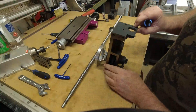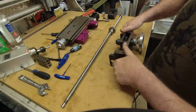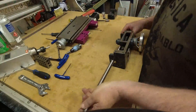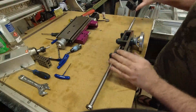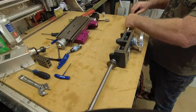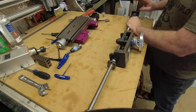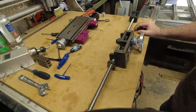We don't tap these holes as yet — we do that once it's on the machine. For initial installation, we put the bearing on the end, ball nut on, slide that through, get our carrier, and slide that on. Initially we just do it loosely because this is going to come off again so we can drill and tap those holes, and then we go and put it on the machine.